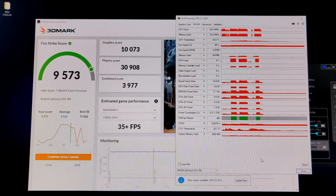So I think these power readings might just be wrong. Especially because before we were hitting the power limit at 150 watts, and now it's drawing 180 - so clearly the limit is not 150 watts. This system has AMD drivers on it; maybe that's the reason - NVIDIA and AMD graphics drivers don't always interact in very good ways. But everything we can see looks fine: just around a gigahertz core clock, memory clock's fine - everything about the 780 seems to work perfectly fine.